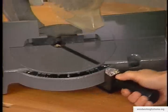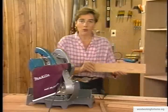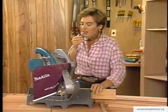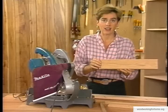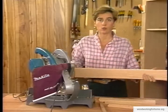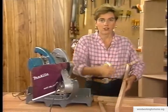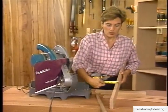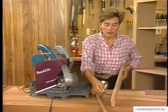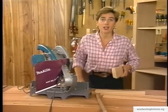Simply take your saw, move it from the zero setting and slide it to 45 degrees, then tighten it down. I'm taking one of the side pieces and just going to cut it. Now I've got a 45-degree angle that's exact, so I'll just measure it to length and do a straight cut to the back. For the front piece with two angles, for every 45-degree miter add three-quarters of an inch to your length. Our bookcase is 44 inches wide, we've got two miters, so three-quarter plus three-quarter is an inch and a half - total length is 45 and a half inches. Ready to install.